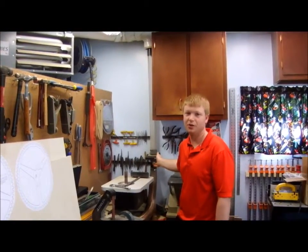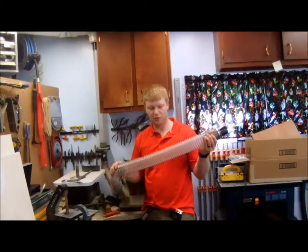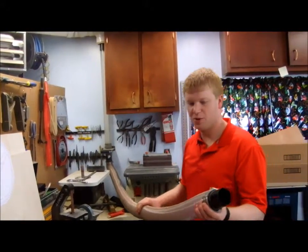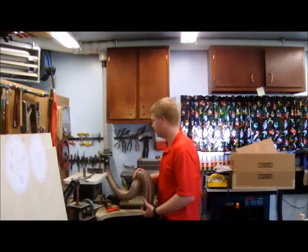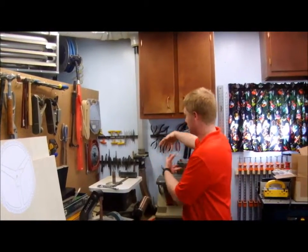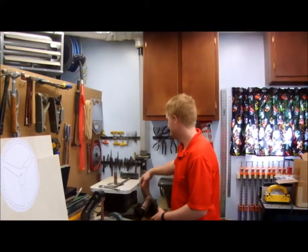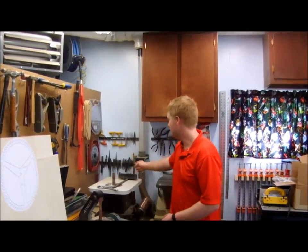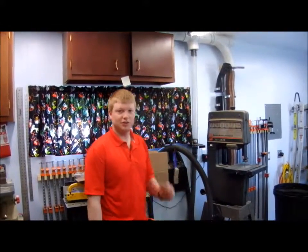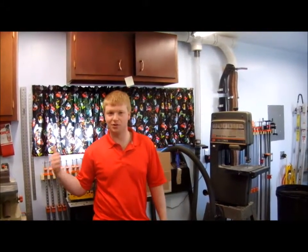I have one drop right here where I knew I wanted to put my workbench, and I've used this so that I can have dust collection with my sanders. Again, this is one of those fancy Rockler expandable hoses. In reality if I get more than a short distance it springs back really hard, but the nice thing is for short distances where even a shop vac hose would be all wound up, it is nice to be able to plug it into these sanders. I've found that I can run two of these dust collection ports simultaneously — if I have either of those smaller ports open there's probably equivalent suction to what a shop vac provides, so I can actually use two machines at the same time.